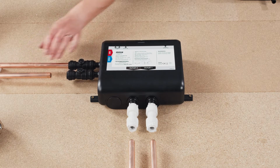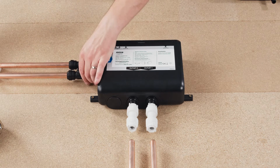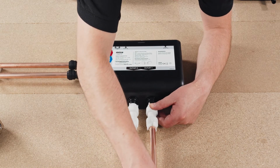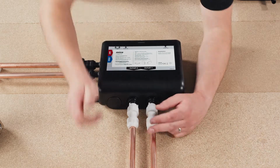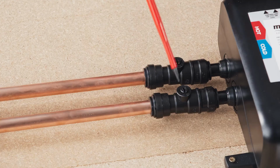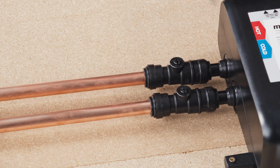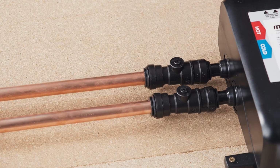Designed to be installed in a concealed location, such as in an attic, under a bath or in an airing cupboard, this makes the installation extremely flexible. Just ensure the valve can be accessed for future maintenance. Water supplies should be flushed before final connection to the valve. This prevents debris from blocking the filters or corrosive fluxes causing damage to the valve mechanism.